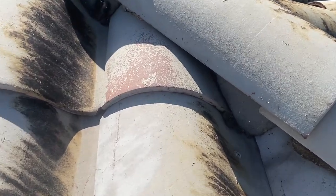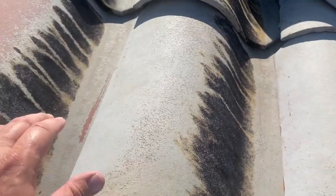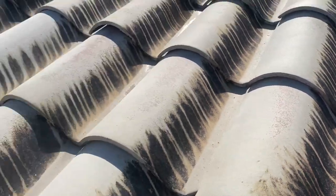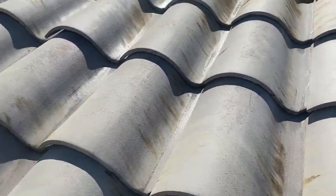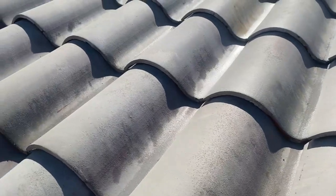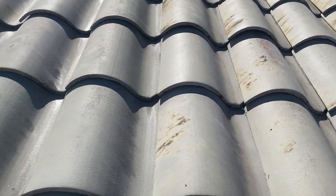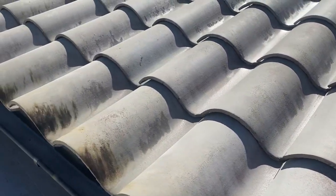This isn't meant to be a full class, just a little primer on tile roofs. It's important to know what's under the tile or what the tile is. This roof is a painted tile roof. Right here is the original color of this tile, but then it was painted this gray color — and you can see we're starting to lose some color on here. This building is probably 25 years old or so. If you were to attack this roof with a surface cleaner, you would certainly lose a lot more of this color. This roof would probably turn about 50% terracotta — the actual manufacturer's color. So keep your surface cleaners and pressure away from roofs like this.